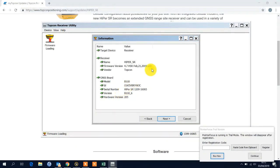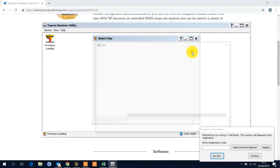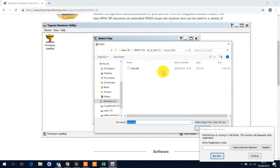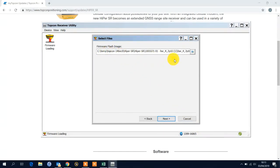Just checking again and cross-referencing the patch and the board version — there was only one board version to download from, so we're good to go. We press Next. Leave the data packet size as default. Hit this file icon to the right just to dig down into your directory and make sure you're loading the correct firmware. I've saved it into a folder called HyperSR and extracted the file into there. It gives me the correct file to choose. Press Open, double check the directory path is correct, and press Next.